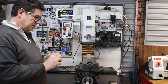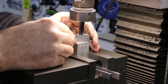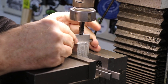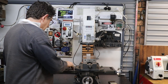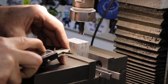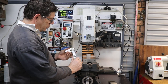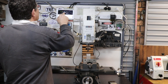The easy way to do it is to get yourself one of these little adjustable parallels and pop that under the end mill in the gap, and just adjust that up till it's a nice snug fit, then slip that out. Take your calipers — make sure they're zeroed — or you can use a micrometer for extra accuracy.